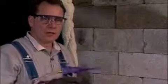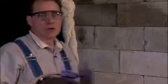Now remember, this foam expands, and you can see how easy it is to fill up a large area with a couple layers of foam rather than one large layer. Now remember, MSHA requires that the distance of the applicator from the surface being sealed can be no more than 24 inches. Another advantage of the P2 applicating gun is that you can meter the foam and apply very small or very large beads of material at one time.